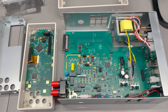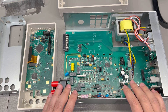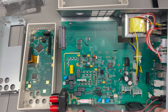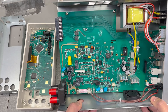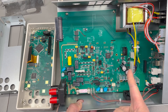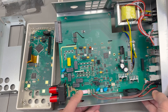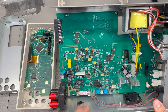As a conclusion, they used very high quality parts in here - these are TI, Maxim, Analog Devices, top manufacturers - and the layout of the PCB as well as the assembly quality is as good as you can get. The only thing I would question is maybe the position of the voltage reference in proximity to the linear voltage regulators and their heatsink. But I'm sure they've done their measurements and observed that the variation in temperature falls within the allowed tempco.